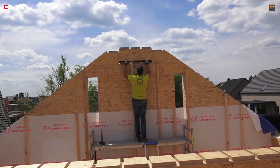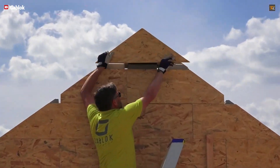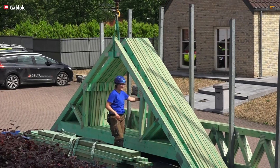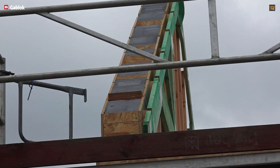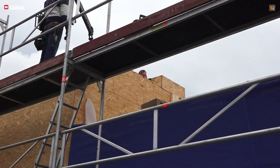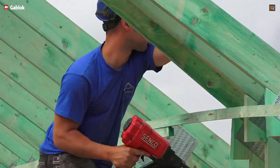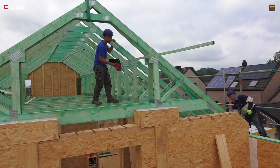With the walls nearly complete, the construction moves efficiently to the roof system installation. All the roof beams are delivered to the site pre-cut, clearly labeled, and ready for immediate assembly, significantly speeding up the final stage of the build. These large pallet-delivered pieces are the structural roof beams. The triangular beams form the supporting skeleton for the entire roof. The beams are simply placed at the predetermined connection points and secured using a screw-plug system. These beams are engineered to be fully compatible with the Gablock wall blocks, ensuring that roof assembly can begin and finish quickly once the walls are complete.